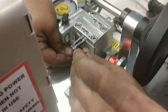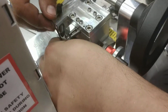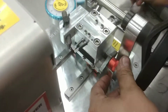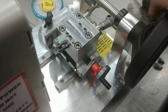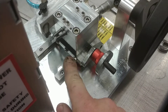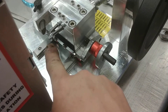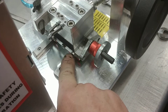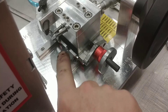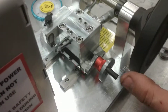The fourth one furthest back you really don't need to touch, but you can. These are also the same screws you would loosen and adjust if you don't like the tension on the cross slide handle — if there's too much tension and it's too hard to spin. Just loosen up these three jam nuts and then loosen or tighten the gib screws with the two millimeter or 5/64 allen wrench. Try to have them all at about the same pressure.